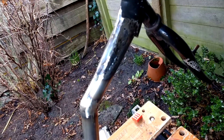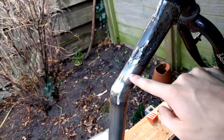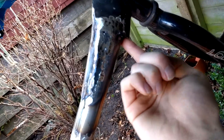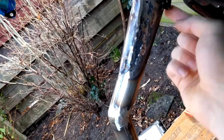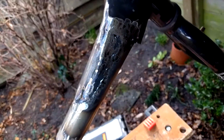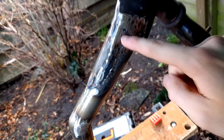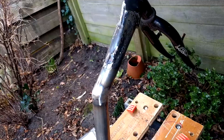So as you might see, this is all ground off. The idea is that I put some bracket in between here because I don't want this to stick out just like this. I have cut a little piece of tube and used it as a kind of shielding material here. I'll do the bottom side now, but as you can see it's not nice at all — because of my welding machine, it's stick welding and I cannot make that very nice. So I'll weld this over again and then grind it off so that it looks kind of good in the end.